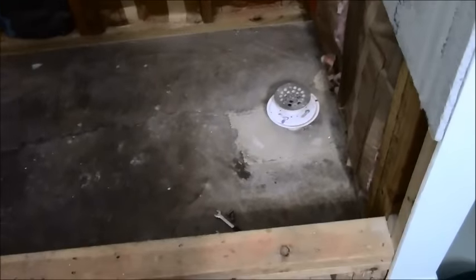other topical membranes, waterproofers allow for their product to be a pan liner. I don't necessarily trust it, but to answer any of the questions out there, yes, you need a pan liner, even on a slab. Other question I get is, do I have to move out my drain to the center?